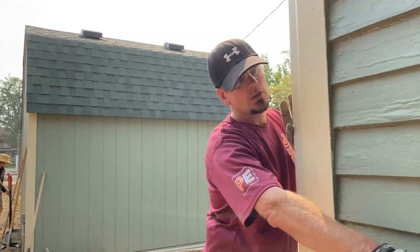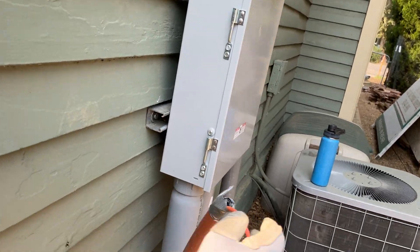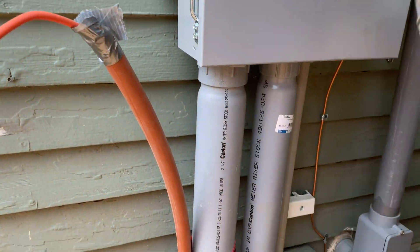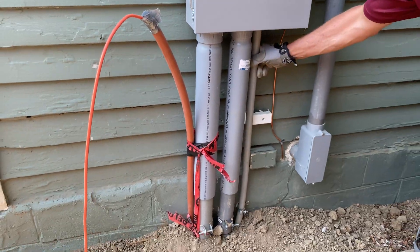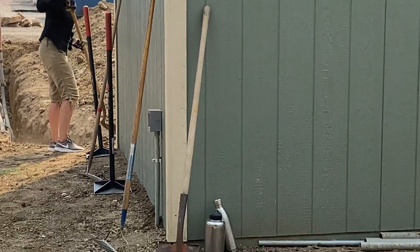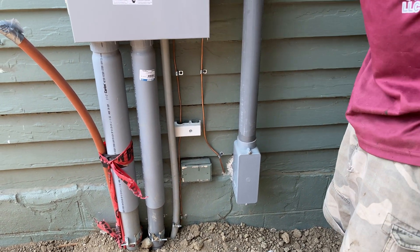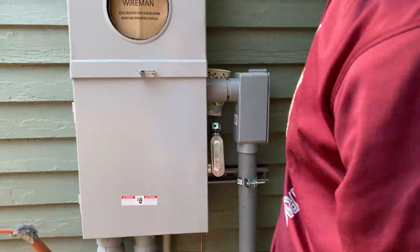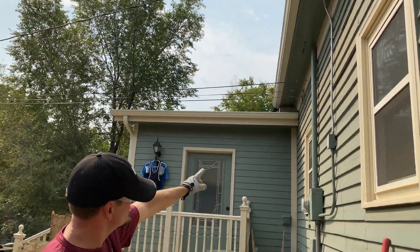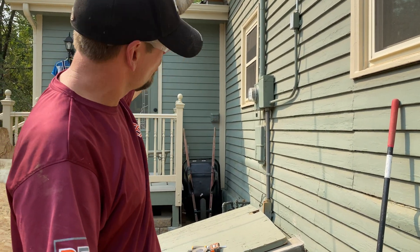So if you see right here, we put strut right here on the back — inch-and-five-eighths to get it to mount off. And then we've got our mini straps and our slip conduits coming up, our coax line coming in. They wanted two — one for over there, one for here. And this is our three-quarter conduit that goes to the shed right there. And then right here, this is our subfeed for our number two going into the basement. This three-quarter is going to feed out right here and pick up that box up there. Then all of this is coming off, even that inch-and-a-half PVC LB going down in the basement — all of that's coming off.